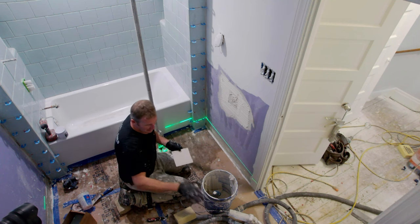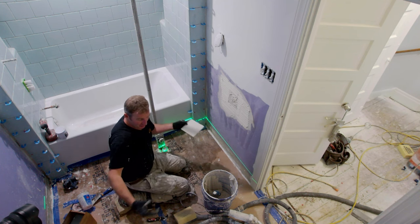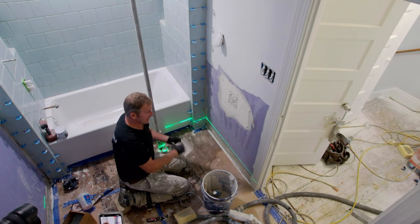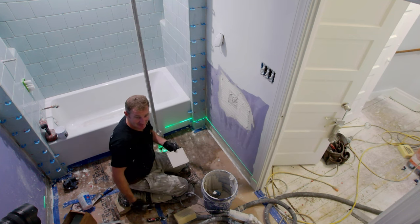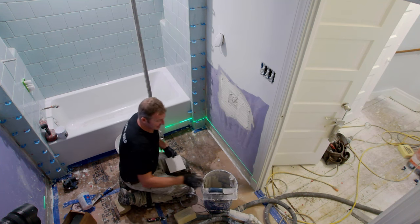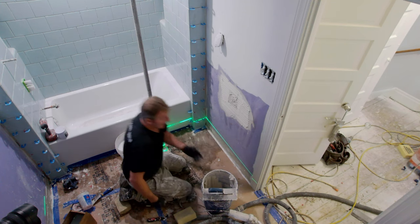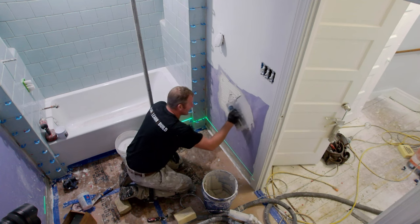It's because maybe the floor is a little bit uneven and you're using plank tile or some longer tile that has a bow in it, and then you're just not getting the coverage in the middle of the tile. So if you're doing bigger tile, if you're doing 12 by 24s or anything bigger than that, definitely check your coverage. You might want to go up to like a half by half. I wouldn't recommend a quarter by quarter for a larger tile like that anyways, but you're going to need the larger trowel. You really should have multiple size trowels on you and then establish what kind of coverage you're really getting.